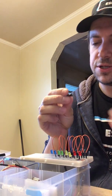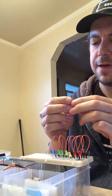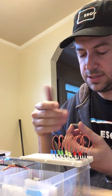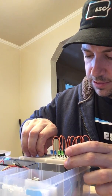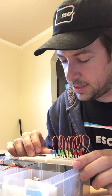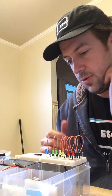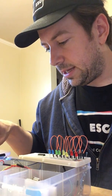So what I have here is called a shift register, and the orientation is really important. This one is the 74HC595N, and you want to orient it so the number piece is facing backwards to me, facing where the LEDs actually are. I know that won't make sense if you're following along at home, but the orientation is meaningful. There's a little dot on the side that helps you orient it, though you probably can't pick it up on the picture. Also notice I'm bridging the gap on this breadboard to separate out each side, because I'll be using different things and different cables on the sides.